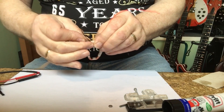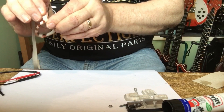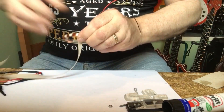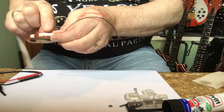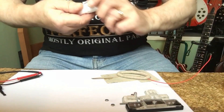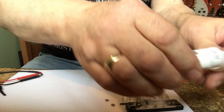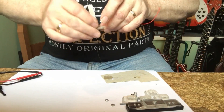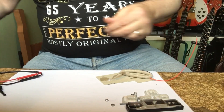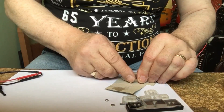As you can see, the handling of this is obviously going to rearrange all of the threads of copper — so as I said, it wasn't too much of a worry about exactly how you lay it down with this particular type of coil. It's about as random a scatter as you can imagine. Nearly done — just a little more gum on the final end, and I always try to put the outside wrapping somewhere on the top so it doesn't get interfered with by the edge of the case or the magnet.